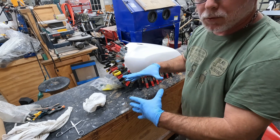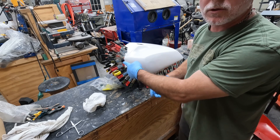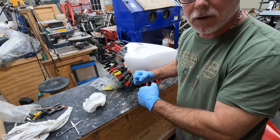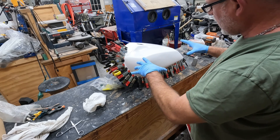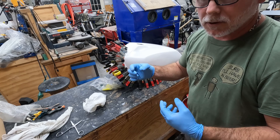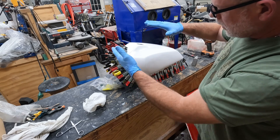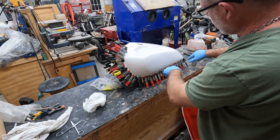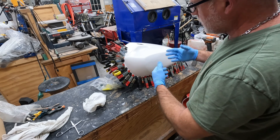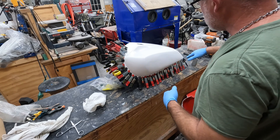The front section is the difficult area where I have to spread it apart. Some of my clamps are much harder pressure — the red ones are not as hard, but the black ones have an extremely harder grip, so I use those as my fixturing parts to really lock the part together. Once clamped, I balance it lightly and set it down so the putty — which still has a little sag — can puddle around the seam area inside the tank, because once the tank is together there's no going back.